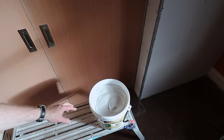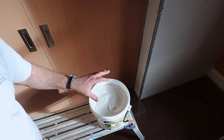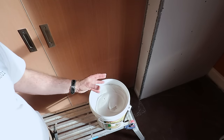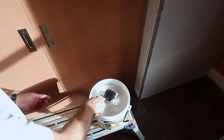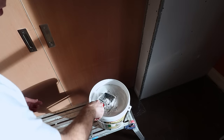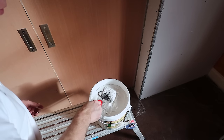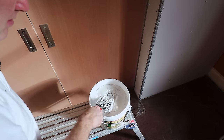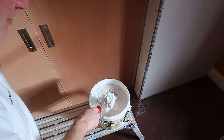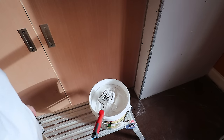I've opened the tub up and as you can see it's quite a thick filler consistency. You don't need to thin it down or mix it — all you're going to do is load one of these rollers up, put plenty on and bed it all in. That will go onto your plasterboard where the joint tape will be, then you put the joint tape straight over it. I'm loading it up nicely and we'll get in a position where you can see what I'm doing.